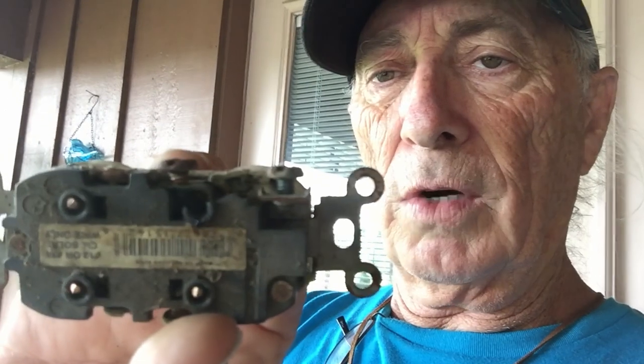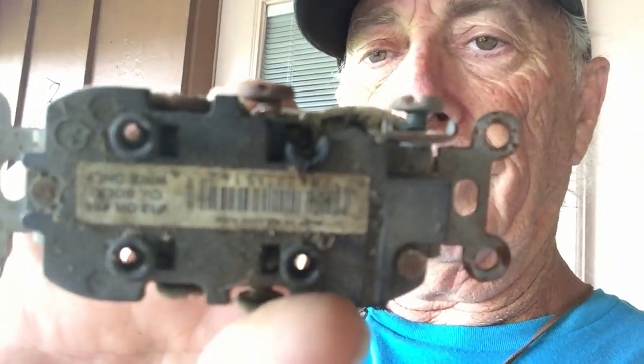I keep running into this. This is the back of a cheap outlet — like a 98-cent outlet from Lowe's or Home Depot. You can see the copper wire where I cut it off; it's the push-in spring-clip type. If it gets a little hot, the spring gets weak, it starts to arc. Look closely — you can see the burn where it actually started to melt on the neutral side. The house should have burnt down, technically.